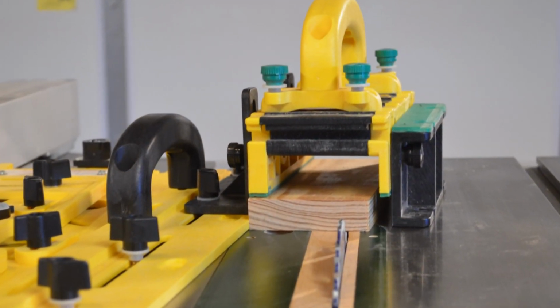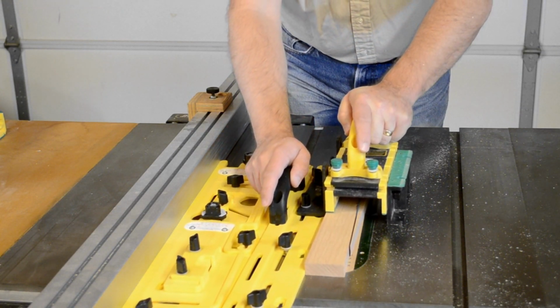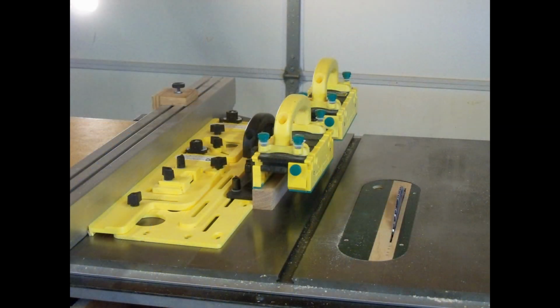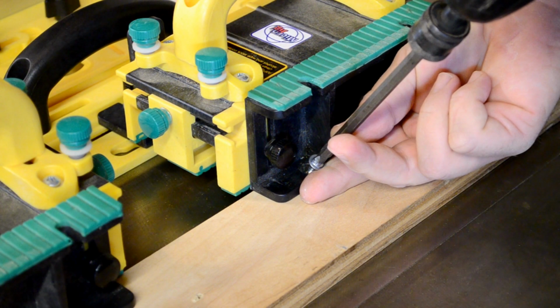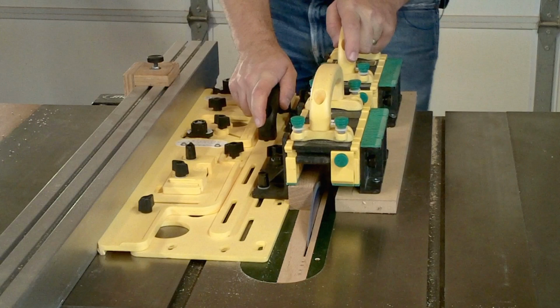Cutting tapers means that the line of the cut relative to the jig and accessories will change as the setup passes the blade. Always be sure to check the entire length of the line to be cut. If needed, you can use the adjustable spacer on the far side of the blade for stability. Thicker parts, like table legs, may even require additional spacer blocks. When using 2 grippers in this manner, 1 long spacer block will prevent the trailing gripper from catching on the leading edge of the saw table.